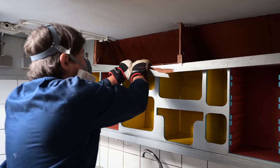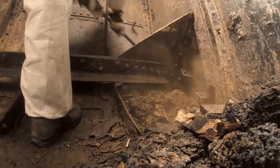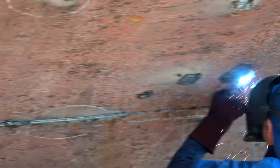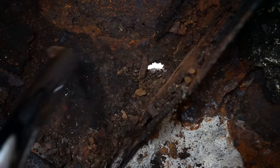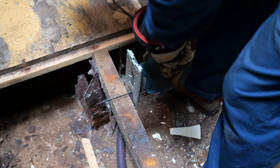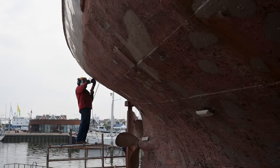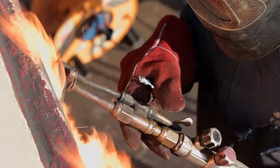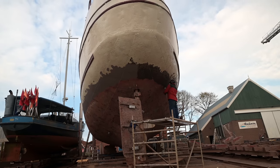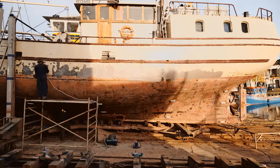Let's bring you up to date. So far we ripped out all the interior from the saloon, underneath the aft cabin and in the fo'c'sle, and removed a lot of dusty old cork insulation together with some frames. After that the lads from the yard repaired the very big corrosion damage. We called in an expert who discovered a very big hole, and while the shipyard was repairing it we continued with massive destruction and removed a tank from hell. Eventually we started de-rusting the waterline and preparing the hull for painting. While doing so we found another big hole and got rid of it by removing an overplating and setting our boat on fire. Then we removed even more rust at the stern and to our very big surprise the hull underneath was in pristine condition. Finally, we finished this enormous task with a layer of two-component primer.